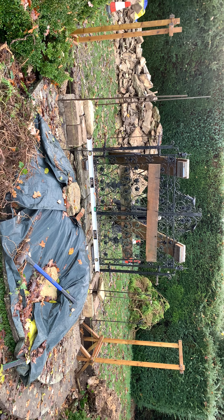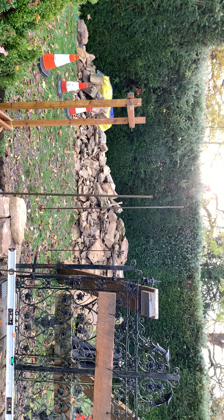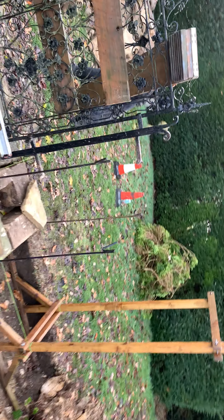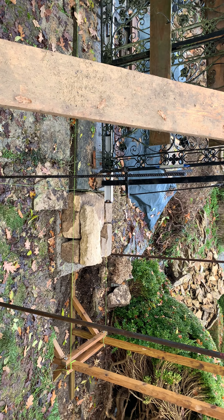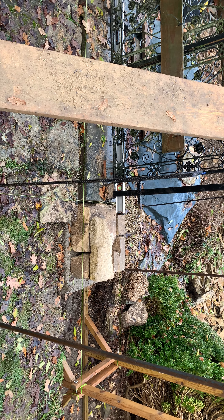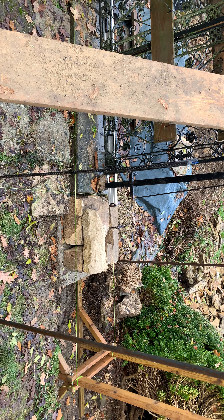These are our two main pillars here. What we're going to do — because as you can see behind, what we've taken out from the old pillars is shot. It's all connected to a load of old mortar, which to an extent you could clean off, but apart from some of the bigger pieces, it really wouldn't be doing the project any favors by putting any of this back in the wall. What we can do — and what was in the base before — was some of these big chunky pieces down at the bottom, which we've rescued and dressed off, as you can see. The stone on top is actually newly quarried — millions of years old, but newly quarried — against the original pieces below them that have just been dressed there.